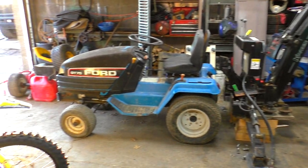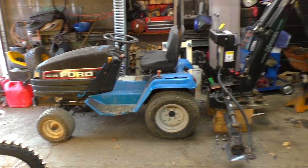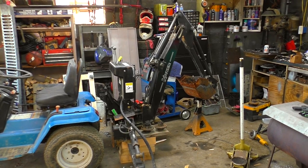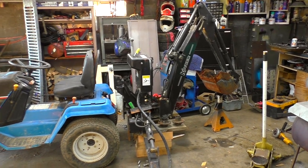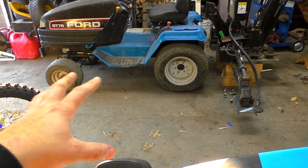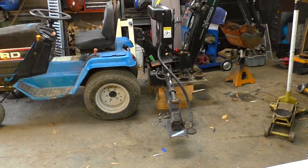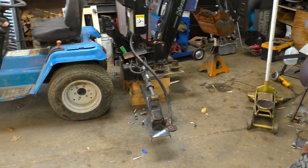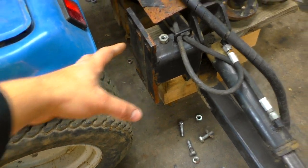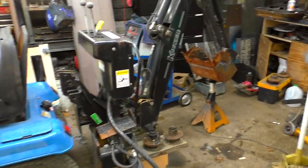Now you could go ahead and put a massive amount of weight on the front — I was planning on putting a front loader on this tractor — but I think we're gonna go with a tow-behind backhoe setup. This is not gonna work out too well. The frame is a C-channel frame, and where the axle sits it's gonna be very difficult to make a framework to hook this up. My goal is to hook up the mounting plates to the existing three-point hitch plates so that way this can get converted back into a three-point hitch backhoe if ever need be.